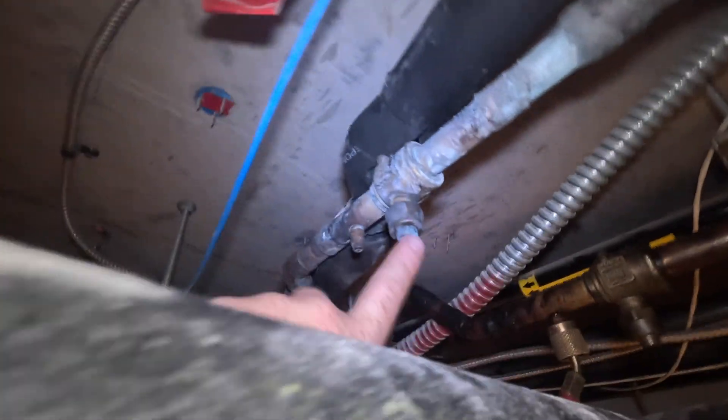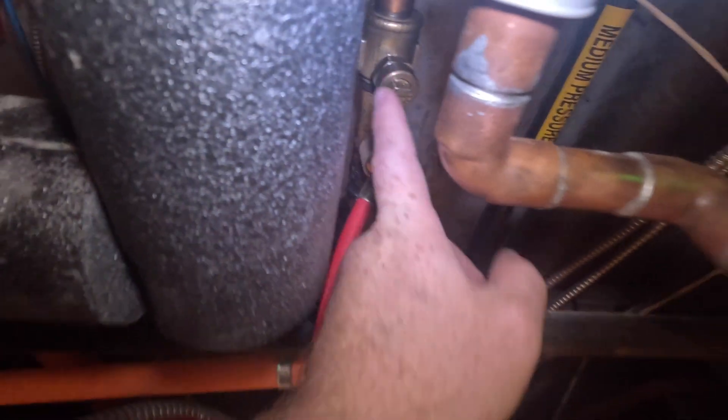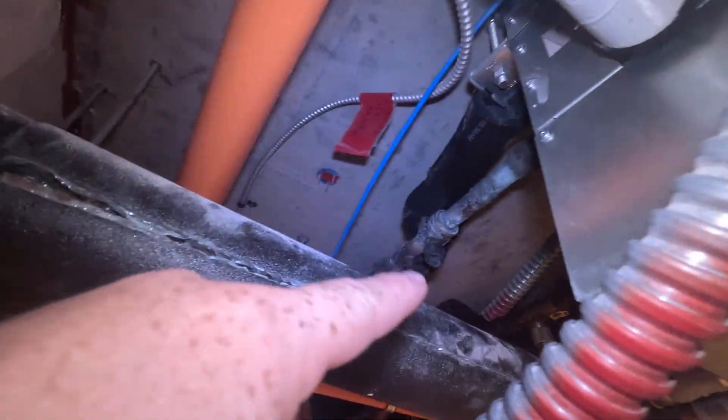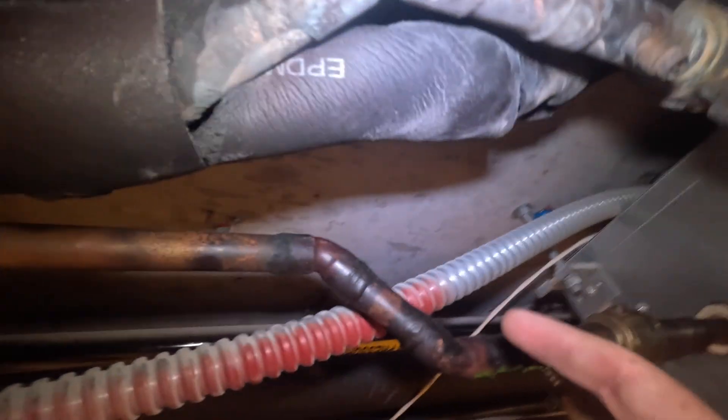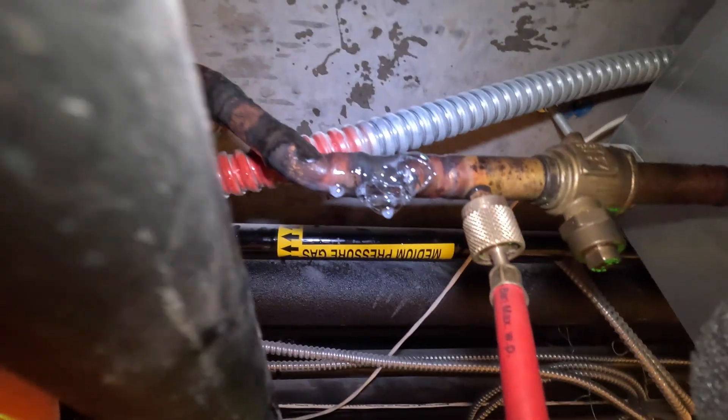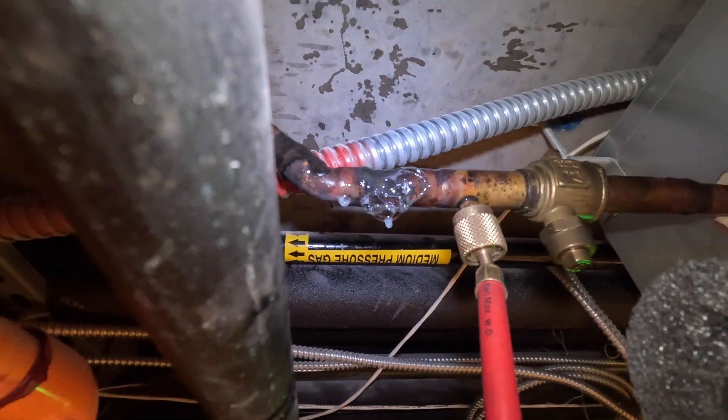He just told me to cover these with a bag and tape off. We got our ball valves right here closed, and here. These indoor units have got to be completely oil-logged because that recovery took forever until we got these ball valves closed off, and then it just shot right down. We need to make a how-to braze video. It's doing another confirmation of where the leak is because there's a lot of brazes on this. As you can tell, it's obviously right there, right next to the port — so that's what we're fixing.